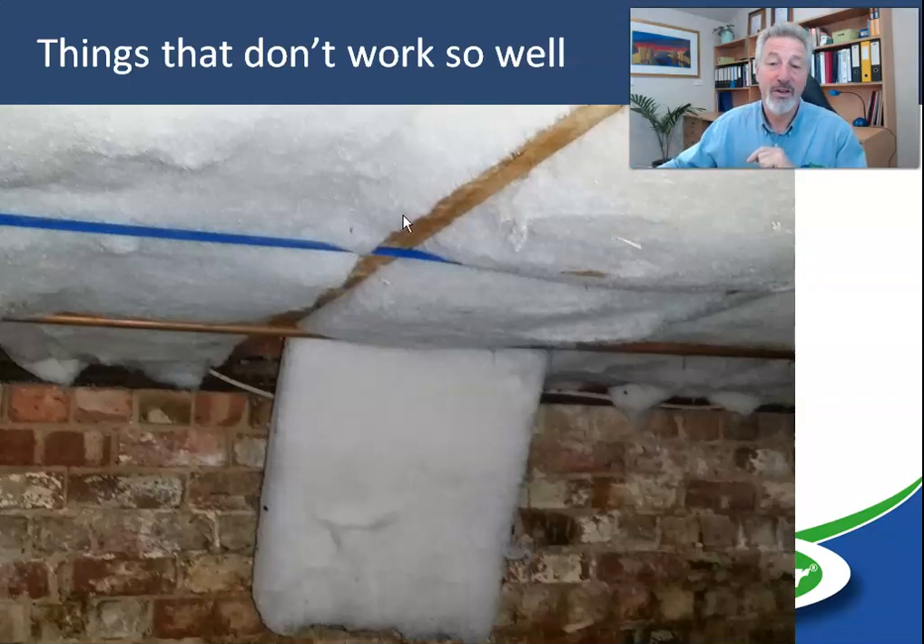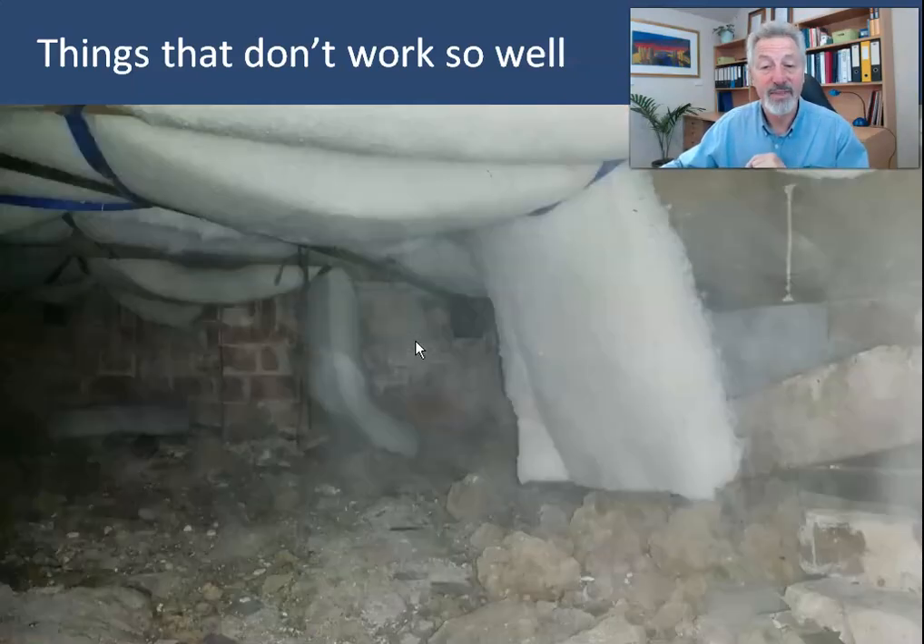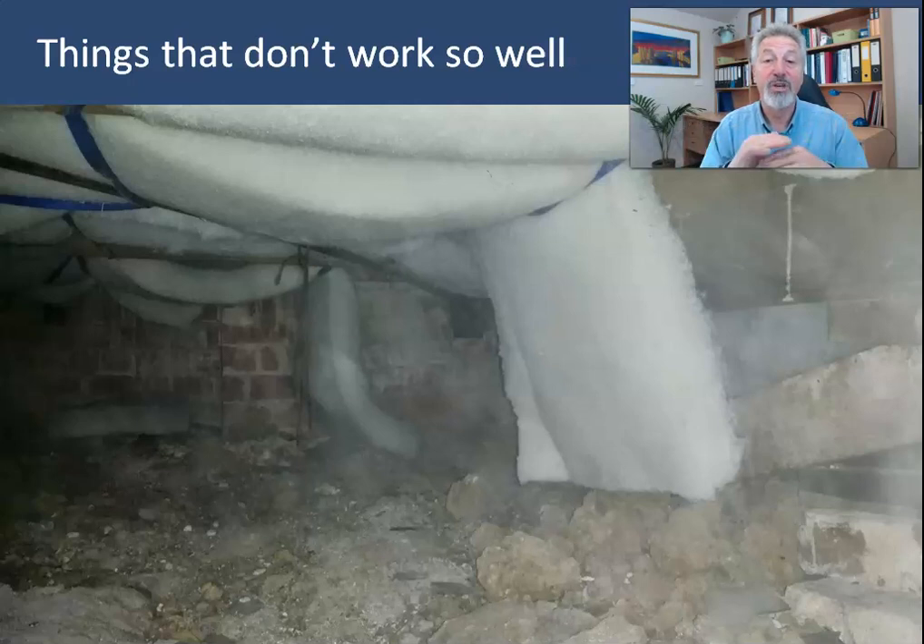You can see here: there's one strap, there's a pipe holding up some of the material — but is the pipe holding it firmly against the floor? We don't know. The rest of the material, friction fitted, is falling down. Ineffective, ineffective, ineffective — really someone's paid a good amount of money for this really good quality material and it's just been wasted by an ineffective fixing method. You can see it's stretching the strapping here and here — strapping is not a good fixing method.